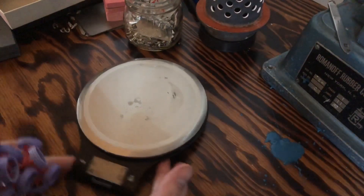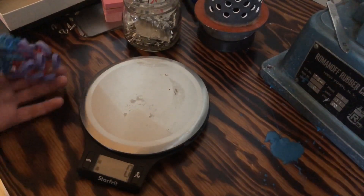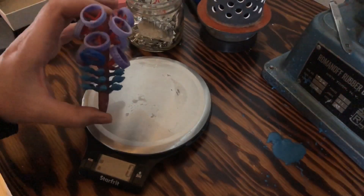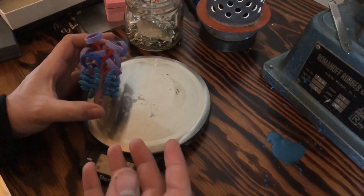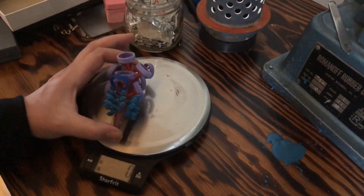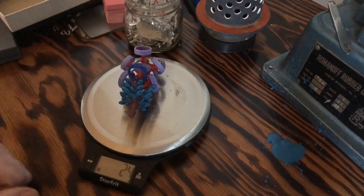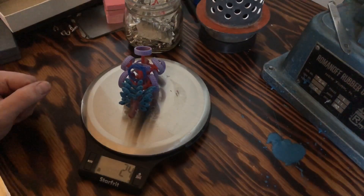This is just a regular food scale I got at one of our local hardware stores. It's accurate to within about a gram, but it does the job. I add a little bit of extra silver anyway to accommodate for the button. Here's the wax — we're going to weigh this very carefully so we don't break anything off. It says 24 grams, so I'm just going to round up and say 25.